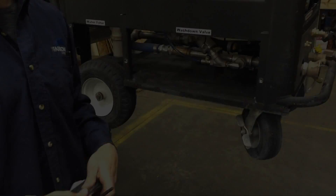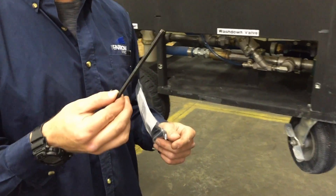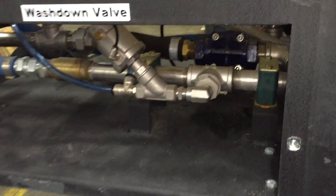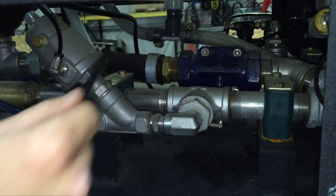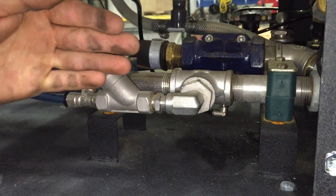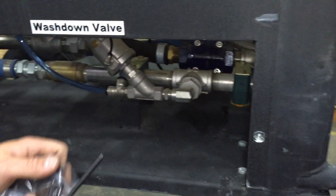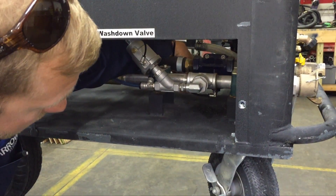For the diaphragm change, the wrench needed is a 6mm Allen wrench — T-handle, socket wrench, whatever you prefer; a socket wrench is probably easiest. For the tightening sequence: go in a cross pattern like a four-lug tire while air is still on the valve, tighten completely, then turn the air off and come back a half turn on each bolt. That lets the diaphragm settle so it's not tearing when opening and closing. Once settled, turn the air on one last time and tighten bolts again in a four-lug pattern. Make sure to replace your airlines — put back the one you took off, and plug in your actual trigger line.